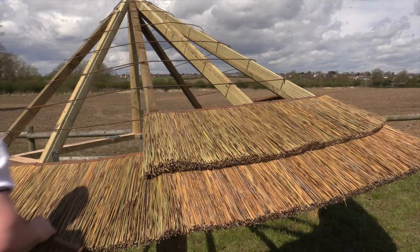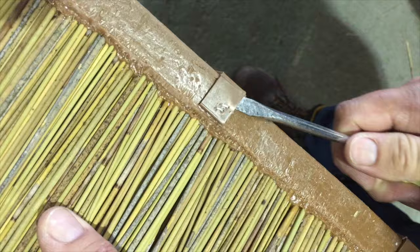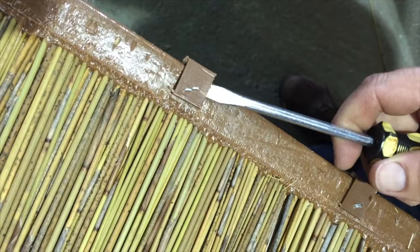Try to stagger any joins in the tiles. If you're finding the clips hard to open, prise them with a screwdriver. There are other ways to attach the tiles — you may want to remove the clips to do this. Simply prise off with a screwdriver and then pull off with a pair of wire cutters from the other side.